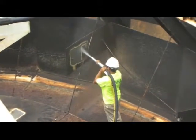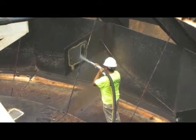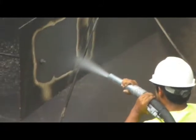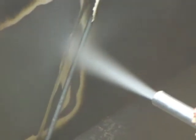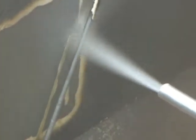Have a look at this. Did you notice how little water was used in the blast? We use about one to two pints of water per minute when we set up with high performance. We use 75 to 150 pounds of media per hour, compared to over 2,000 pounds of media in a conventional sandblaster.